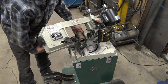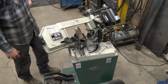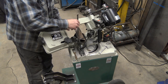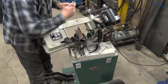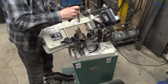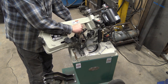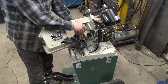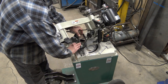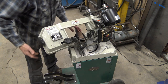Then you simply turn this around a half turn and cut the other side. One thing that's really critical for a perfect saddle cut is making sure that this face is square. A real easy way to do this is I've got a machined surface here, so I can just set my combination square in here until it's flat — it'll sit on that machined surface — then push my pipe up against that and up against the stop, and I know that I am square. On a chop saw you can actually set a square in there too because a lot of times the bed is sitting there with a little bit of room. After you do this a few times you'll probably develop an eye for it.